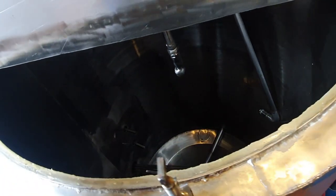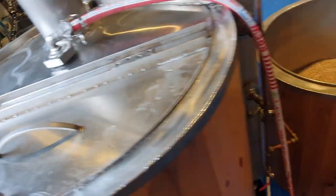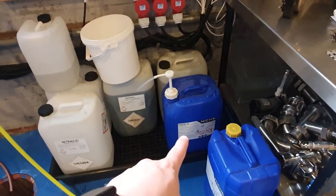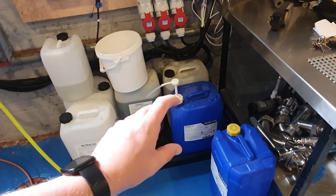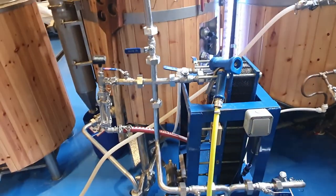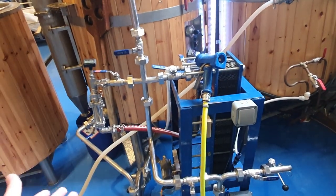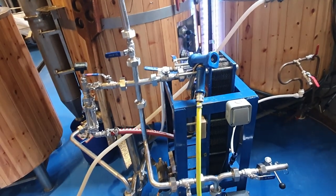What I'm going to do is drain the bottom of this tank, push some water through the plate chiller, and then give it three or four rinses with fresh water. Then we're going to put some Persid 15 in there at the right dose — which is only about a pump of Persid 15 per bucket, it's very concentrated stuff — and recirculate that through all the pipework. We've cleaned it with a caustic cleaner, we're rinsing it, and now we're going to sanitise it with an acid sanitiser.